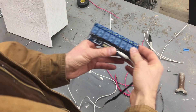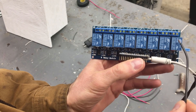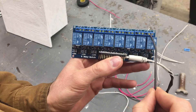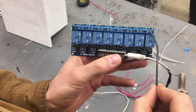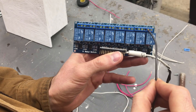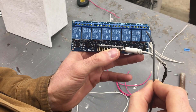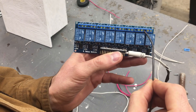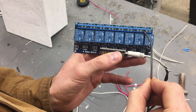Here's how the relay works. In the center, terminals 1, 2, 3 are hooked up to one relay; the next set of 1, 2, 3 to the next relay. The center one is your common — that's where your power goes in. This side is normally open, which means the connection doesn't work until you power the relay. The other one is normally closed, meaning when the relay is not powered, power flows through that side. So if you want your lights on right now you'd use the normally closed side.